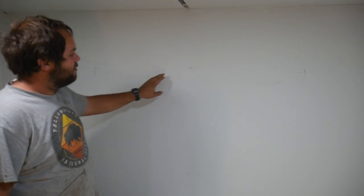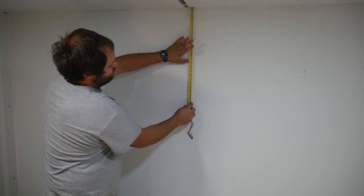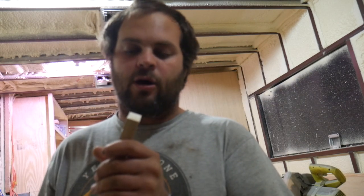So I have marked out a few marks here. There's going to be a big RV window here, and this is the outer corner, the top of the outer corner. The overall height of the shells is going to be 13 inches, which is right here — roughly about an inch above the window. I know it's kind of tight, it's a big window, it's going to be right by your head. I'm going to be building all these cabinets out of poplar. It's a nice wood to work with, takes paint very well — with a slight sand coat you can't see the grain. It looks really nice, easy to work with, doesn't split, and it's a relatively tough wood but not real brittle like oak. With oak, if you paint it, a lot of times you can see the grain through it even if you sand it.